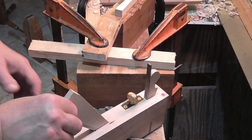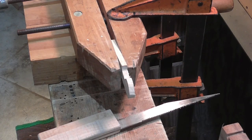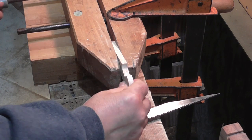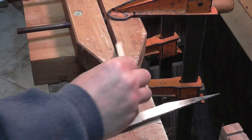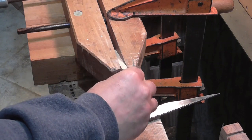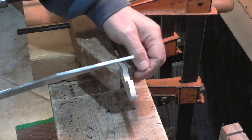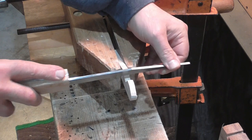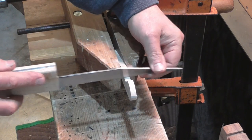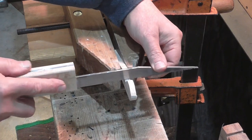Alright, I got a little more fitting and fussing but that's the idea. So I just roughed out the wedge for the knicker on the dado plane, so I'm going to start shaping that. I got a rat tail file and some of the plane maker's floats. That's how I usually do it — nothing fancy. I cut it out with a coping saw.